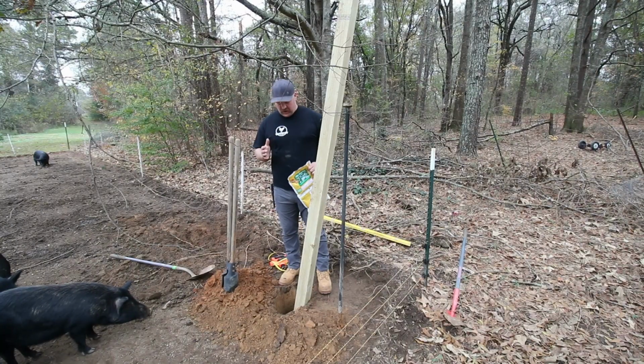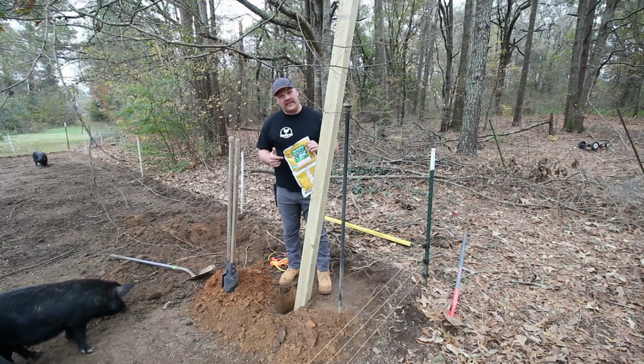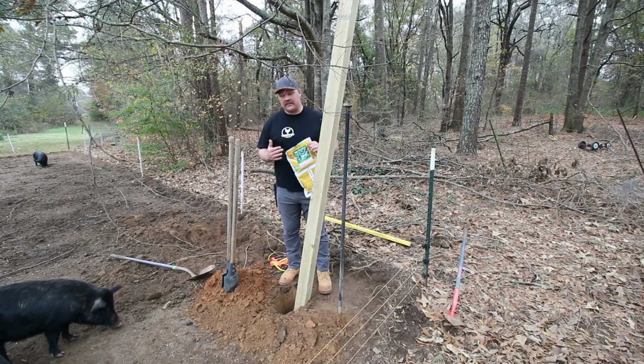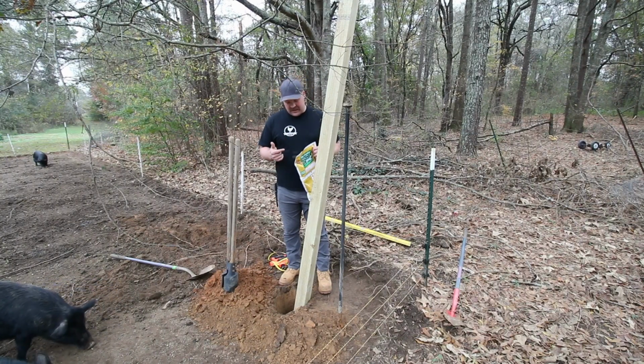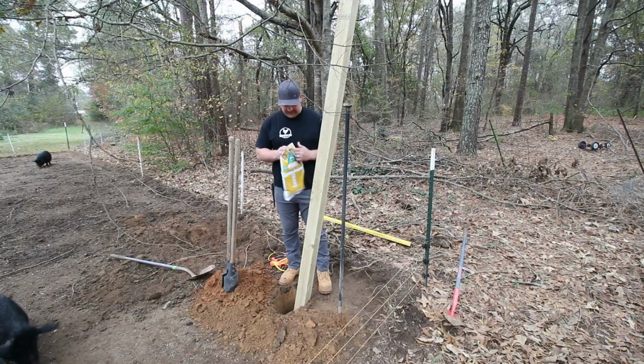All right, this is a big old post. I wouldn't recommend setting posts by yourself. This stuff sets up so fast. I know I'm not going to have to be here long, and I won't have to hold it. It'll be set up pretty quickly. Got my level behind me. I'm ready to go. So if you're using this stuff, just follow the instructions on the bag.